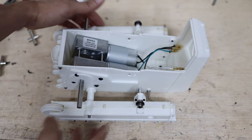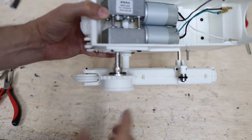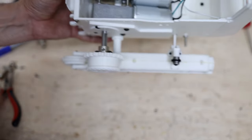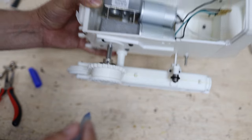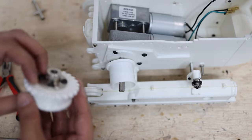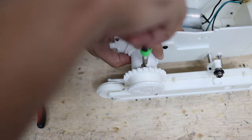Here is the assembly with the two undercarriage parts. Now we need to put some nuts here. We insert the sprocket until the center line of the gear is coinciding with the center line of the undercarriage, then we mark the part where we have to make a mark with the Dremel. We insert the decoration part here, then the sprocket, and using this opening we insert the screw set that is going to hold the sprocket in place.